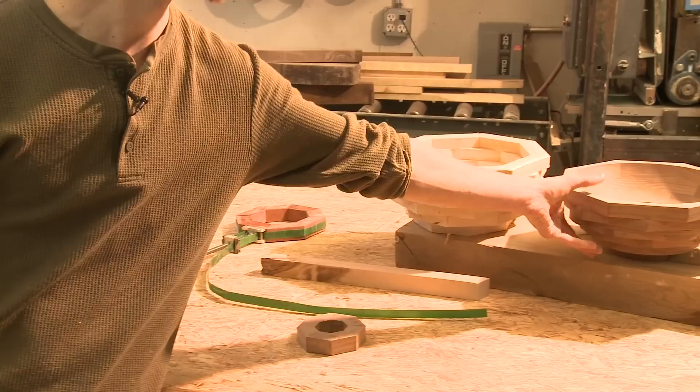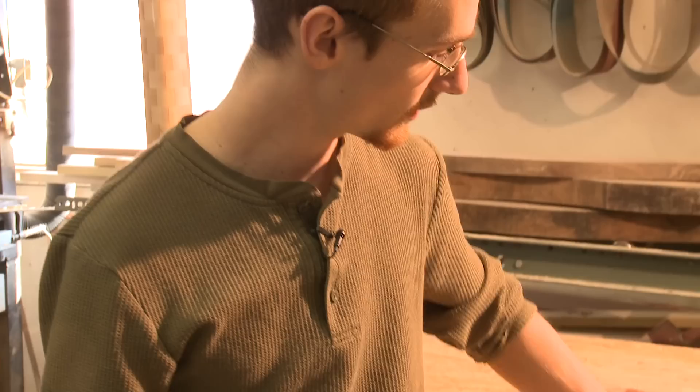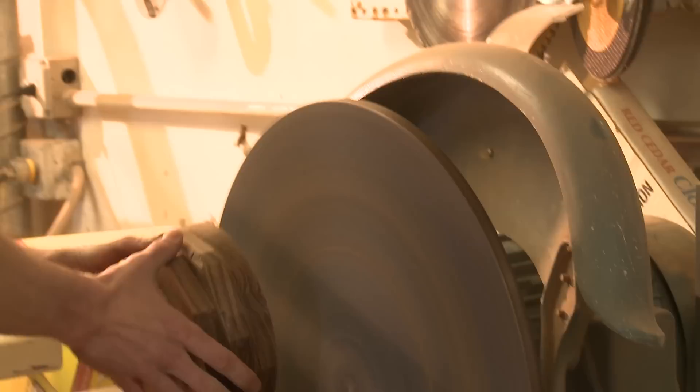There's also an example of a turning from the inside, and after that you get the other half and sand the face all the way around so you have a good glue joint again, clamp them, and start turning the outside, which is what I can show you now. It's gonna get dusty.